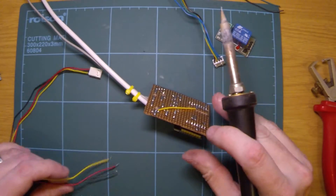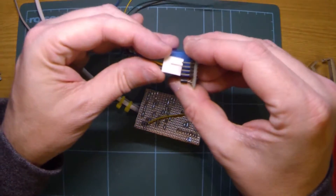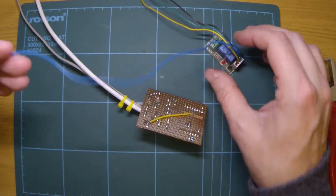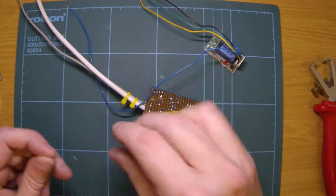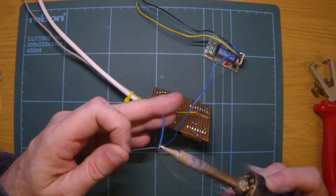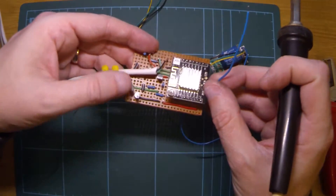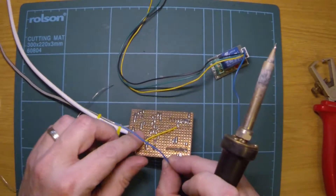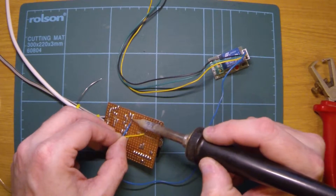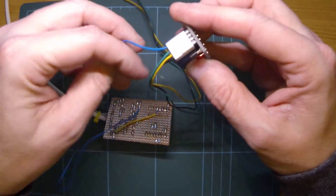So that's those three off. Now when I plug this in, the blue is going to be the supply, so we'll just tin the end of this and get that back on. This one there — get that one on. And the middle two pins are both earth, so I'll actually use the green one.